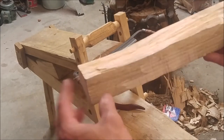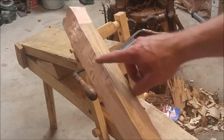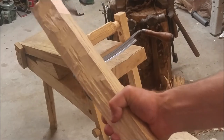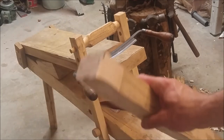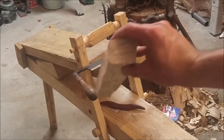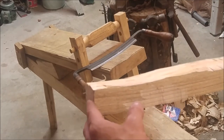Down to the bottom — this is going to be the bottom — we'll have the same kind of idea, so there'll be a flare at the bottom and a flare at the top. This area in the middle is where you hold on to the handle, so you want a smaller area for a good grip, and then again small at the top. Make sure you leave enough length — this hatchet handle is going to be very small because the hatchet head is small, so I'll have a little bit of extra material at the bottom here to cut off.